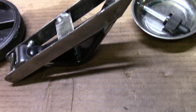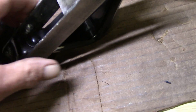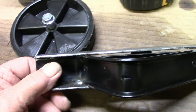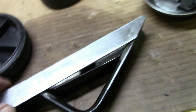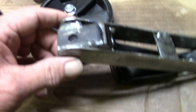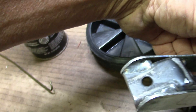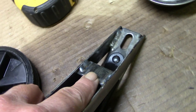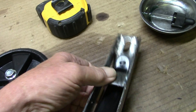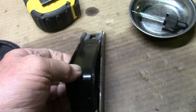So what I've done here is just flat stock — it was one inch wide, 14 gauge — and I just ran two strips up each side from the top hole down to the bottom hole, and then just put some welds on it. I put a little piece here in the middle to strengthen it up, but that's pretty much it. This thing is strong — I guarantee he's not going to be able to bend this.